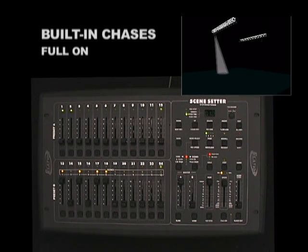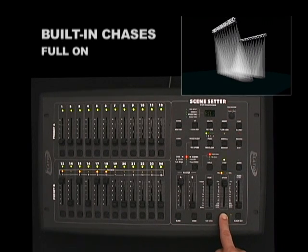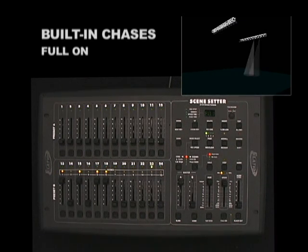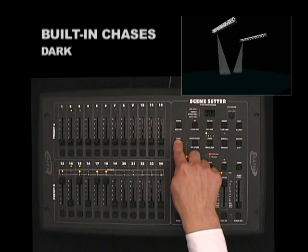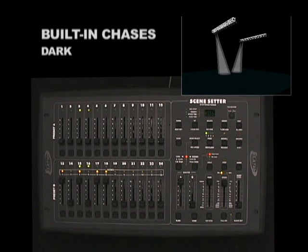If you wish to have full on, you can press the full on button to gain momentary 100% full intensity output for all 24 or 48 channels. Pressing the dark button in this state will momentarily black out all channels until you release the dark button. The chase will then automatically begin to play again.